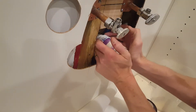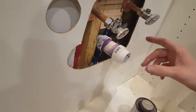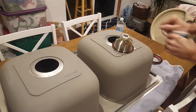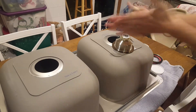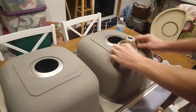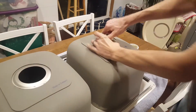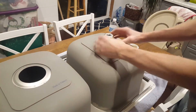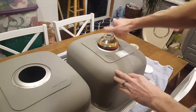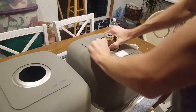Once I have all my glue attachments done I can move on to getting the sink ready to install. It's a lot easier to attach everything with the sink upside down and on the table like this. The first step is to put plumber's putty all around the drain. I now can insert the drain from underneath and then I'll screw the locking collar on the top. I'm just trying to tighten this as much as I can with my hands. The goal is to have most of the plumber's putty ooze out the other side.